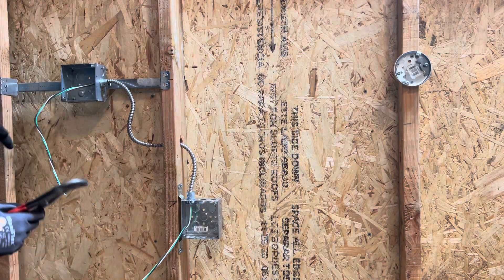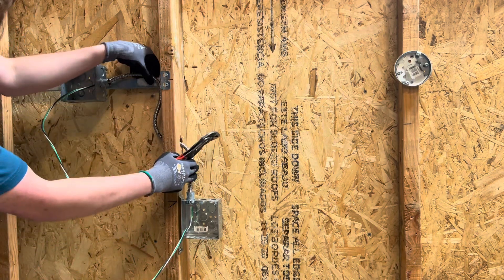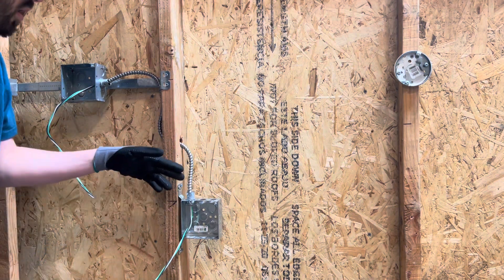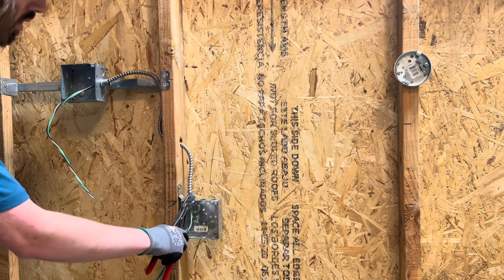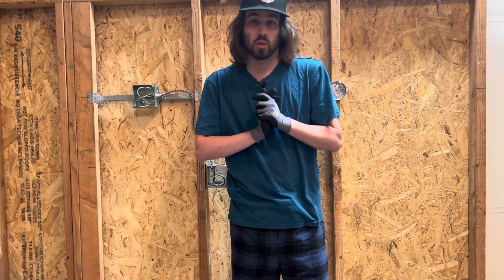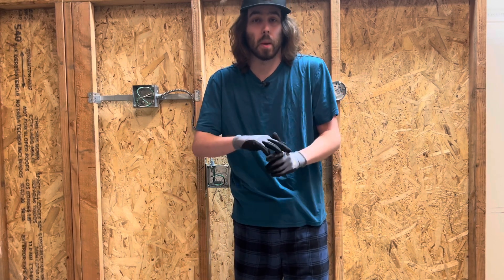Besides that, all you do is pinch it down on both sides — as you saw, it was extremely easy to get it in there. Then you can go ahead and throw a staple on the wire, a zip tie, or another staple. That's a super basic way to install your MC connectors — whether you just want to push it down or use the pinch method with channel locks, a couple times on each side and you're good to go. Anyways guys, that's going to wrap up this quick short video. Thank you so much for watching — hopefully you guys learned something. See you in the next one, god bless, love you guys, peace.